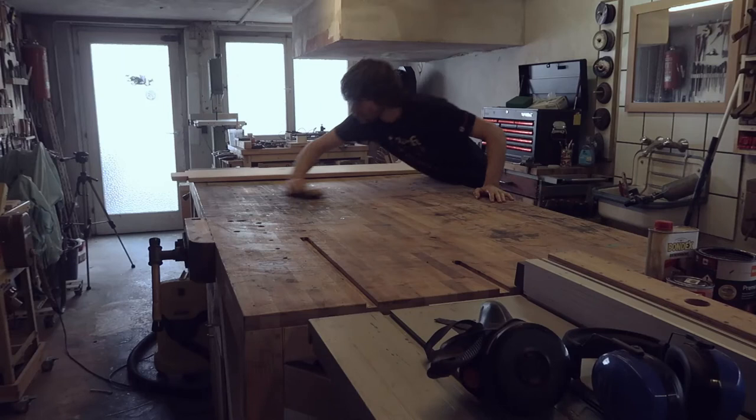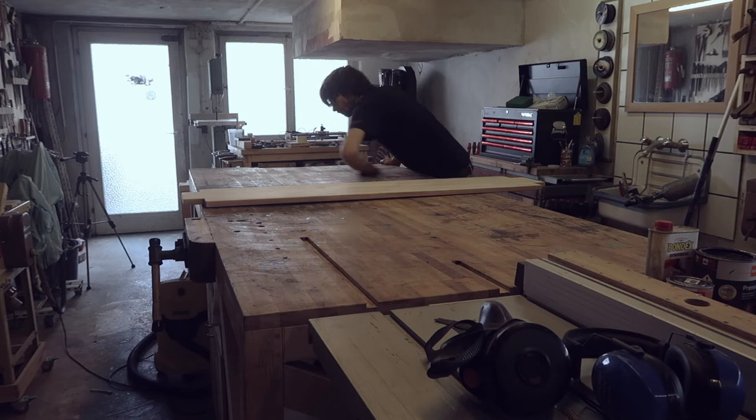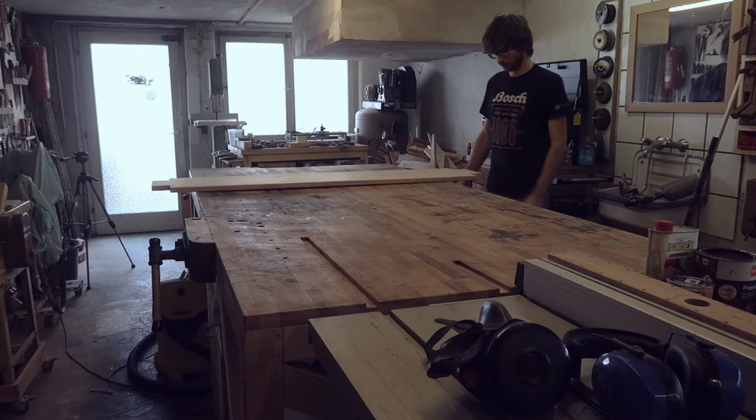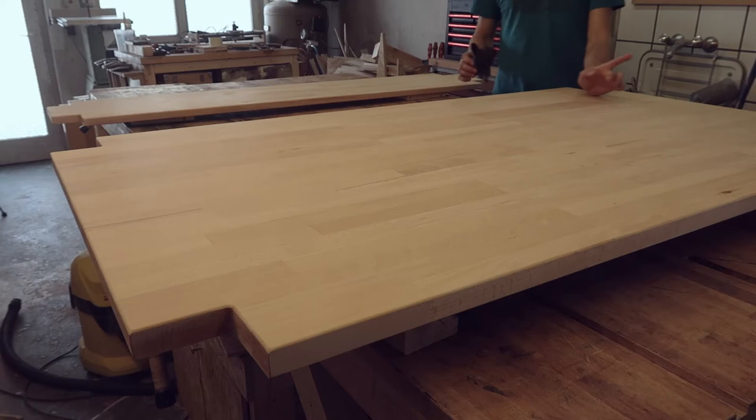If you saw in one of the previous shots, I wiped down the table, so got all the dust off of the table. That's really important. Then I went out of the workshop for a couple hours, let all the dust in the air settle down. And now I'm going to take a damp rag and wipe down the things that we're going to paint. So we're going to put the clear on these two. I read a little bit about that clear, and you can't spray it, unfortunately, so we're going to have to roll it.